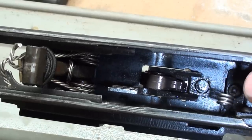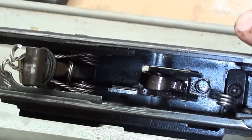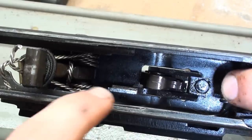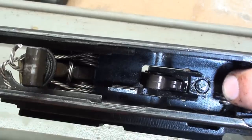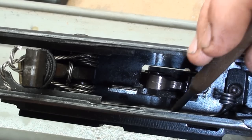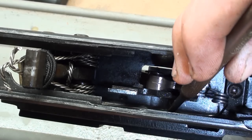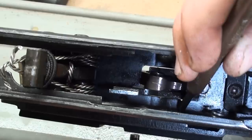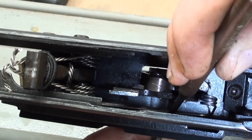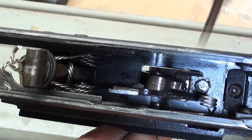So that means the rear axis pin needs to go under the wire. You can have the arrangement either way, whatever's easier. I've found that it's easier to compress the rear one — it's a lot easier to compress and actually get the axis pin under it. We're going to take the flat nose punch, compress the wire retainer just enough to where we can get the axis pin to go over the top of it, like so.